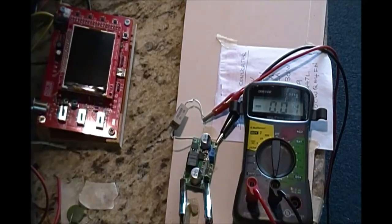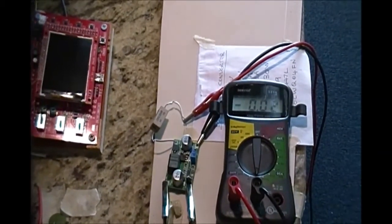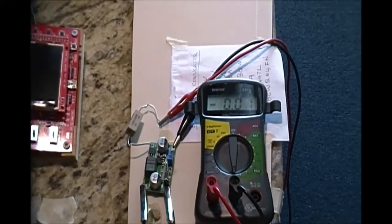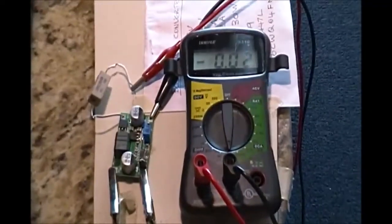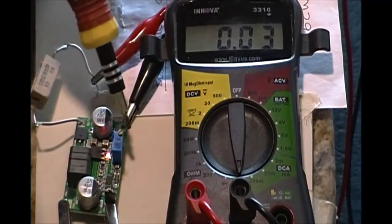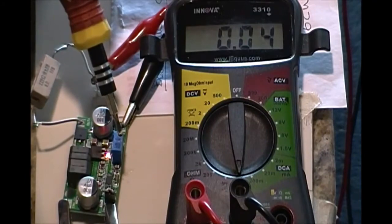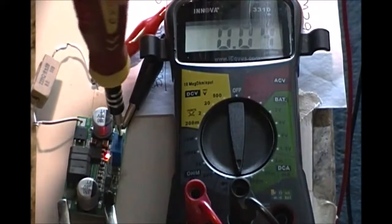The calculated current through the 228 ohm resistor was about 0.13 amp at 30 volt. I connected the meter in series to measure actual current and adjusted input voltage up and down. It was seen that current was directly related to input voltage but did not exceed 0.08 amp at 30 volt.